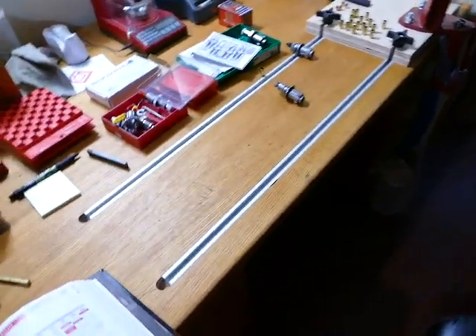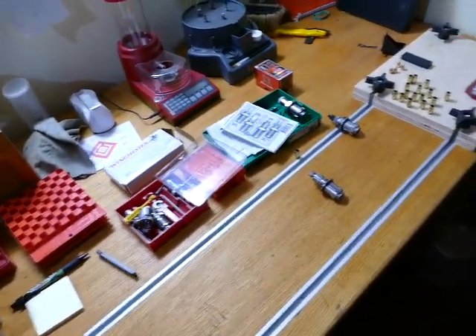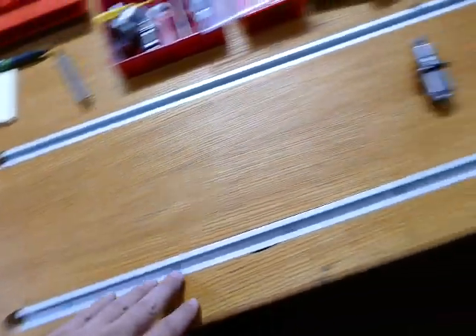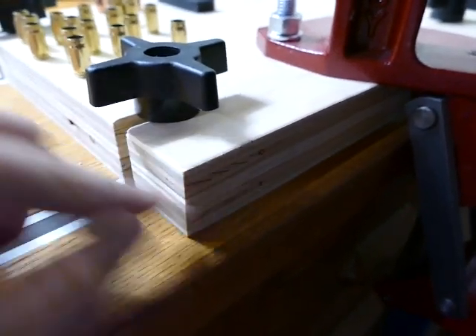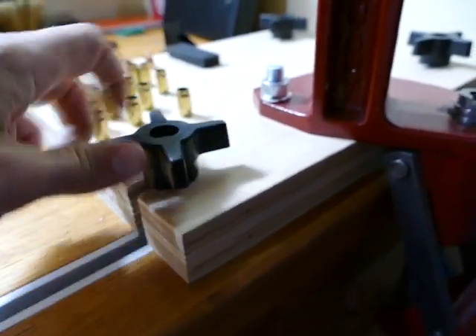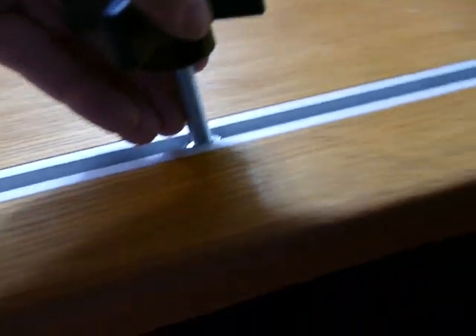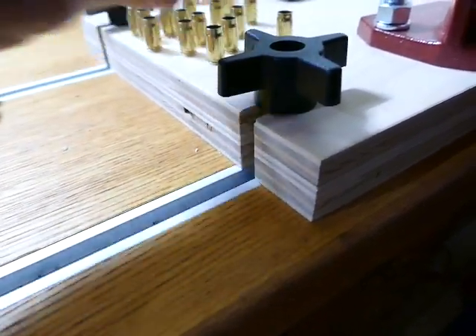Real quick, this is my loading bench. It's a neat little thing I picked up from Gavin Tube. It's an old oak top bench that actually came out of Southern Bell, which is our telephone company around here — old, I'd say 60s, early 70s. It's got a really thick heavy oak top. I ordered some three-quarter T-track and routed it in, stopped it early so I can have a little place right here. I got some five-foot sticks, and what you do is you laminate some three-quarter plywood, lay them on top of each other, glue them, clamp them, cut them to size, then cut your little grooves on the side to match your T-track. You can take these out and move them around.